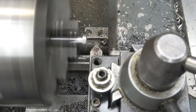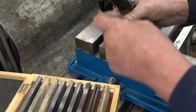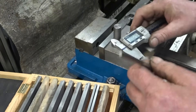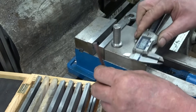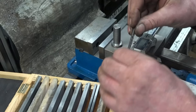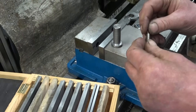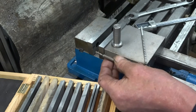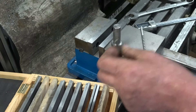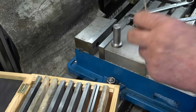I'm just going to knock that sharp edge off — don't want to cut my fingers on it. Next we need to machine a slot down there for that to go into. It's actually an eighth of an inch thick, with a 3mm cutting edge, and I have got one left — an eighth-inch high speed steel milling cutter. These haven't got a great life expectancy, especially when it's the last one. If you've got a spare one and it's a Sunday morning you can normally get away with it.